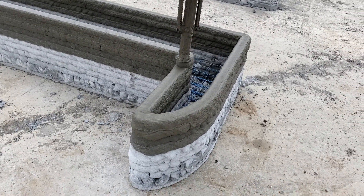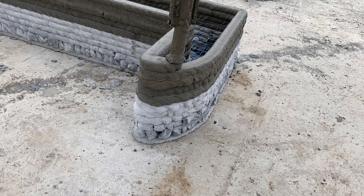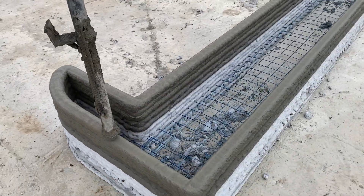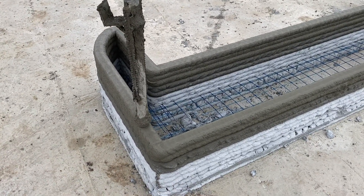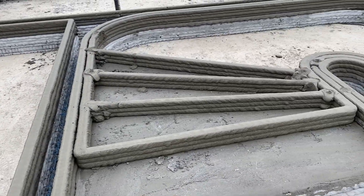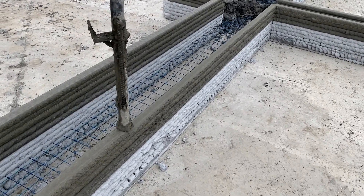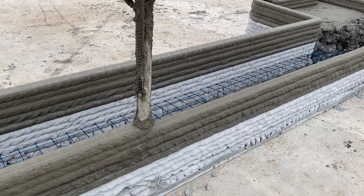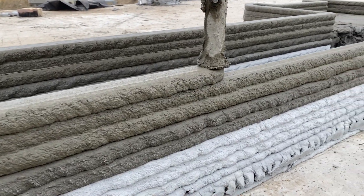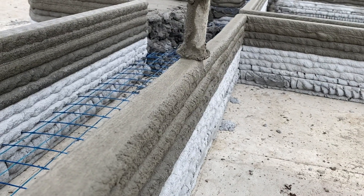Like all kinds of 3D printing, it may not look fast second to second, but SmartBuild said they're able to print 45 centimeters in six hours. These layers look about two, maybe two and a half centimeters tall, so that six-hour print time gives you about 18 layers. The bottom of the section we're looking at now looks substantially worse than the rest of the print. Things don't always go perfectly, but the first layers — the printer is able to smooth itself out fairly quickly if you slow it down because the extruder stays extremely level. You can also push the material into the center if you're unhappy with the finish and go back and do it again.